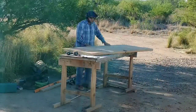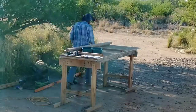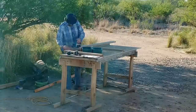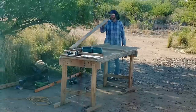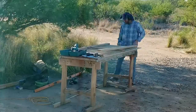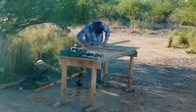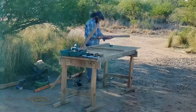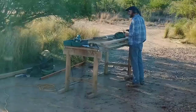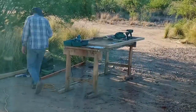The frame needed a little work as well. Some of the boards were a little warped and needed to be straightened out, so I used my hand planer for that. Making a front door seems like it should be a simple task and in a lot of ways it is, but it needs to be pretty precision work. It needs to fit into the hole exactly — it needs to be square and flat, it can't be warped. So I'm looking at the boards, making sure they're not warped so that the door won't be warped, and making sure it ends up exactly the right size.